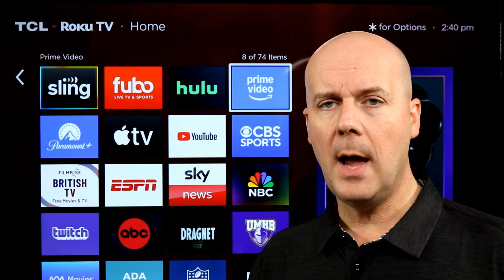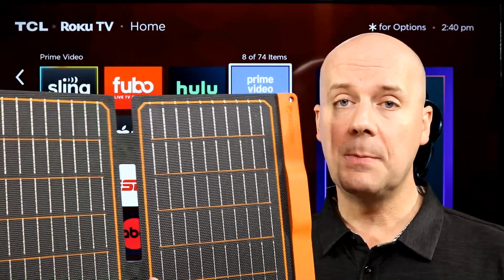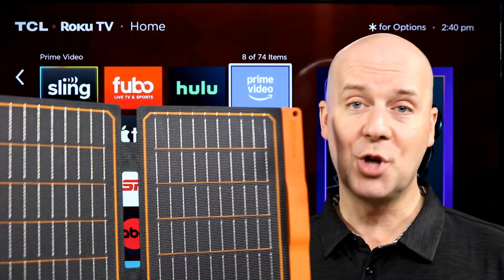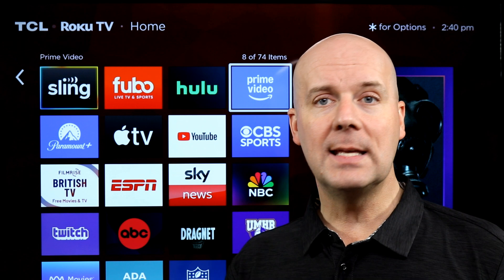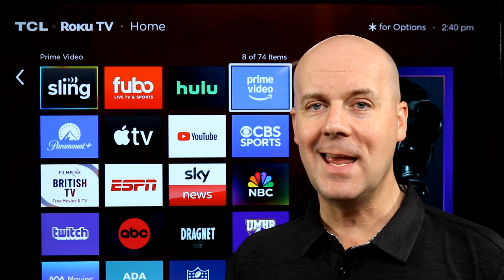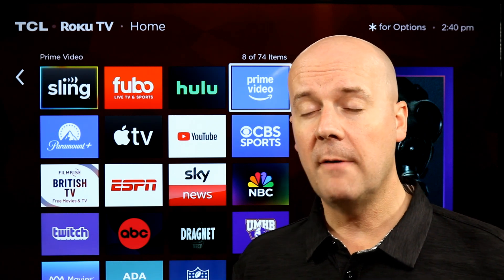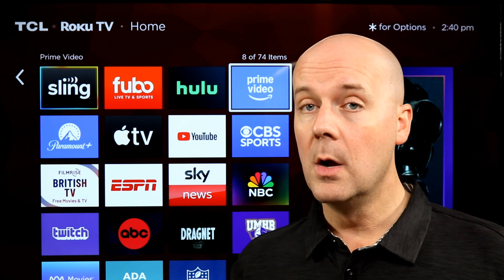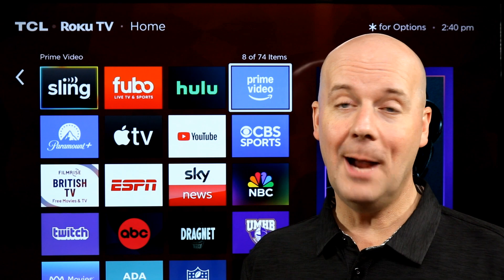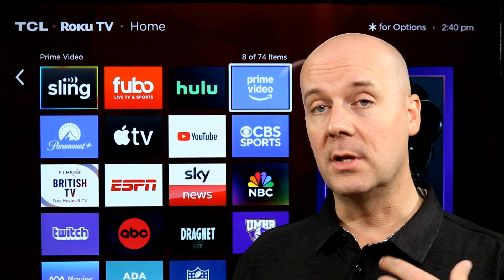This is a nice charger best paired with a battery pack. What I have in my emergency pack is a 20,000-milliamp battery pack, with the idea that I would plug this into the battery pack to recharge it all day, and then at night I can take that battery pack inside and plug it into my phone, tablets, and recharge those overnight as I sleep. I would recommend at least 20 watts for an emergency panel like this if you're one person. If you have multiple people in your house, you may want to consider a 40-watt or larger one if you're trying to charge three or four phones, tablets, Nintendo Switches, and the like. This is really meant to recharge one device at a time.